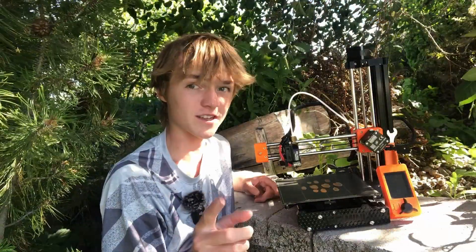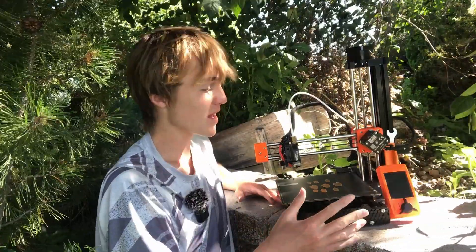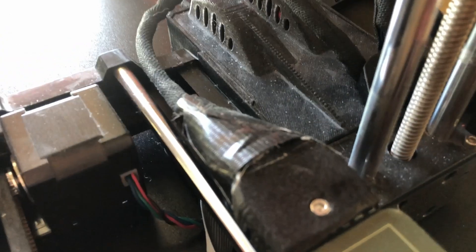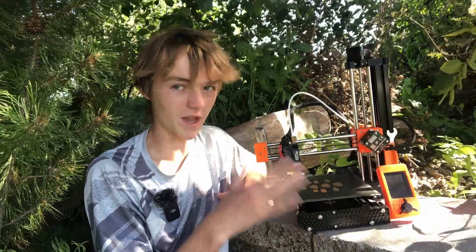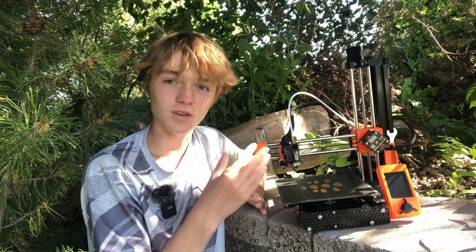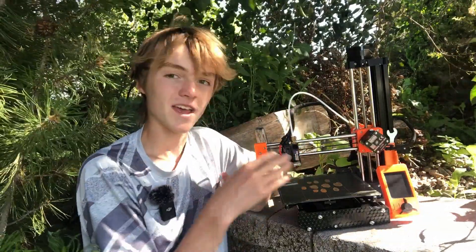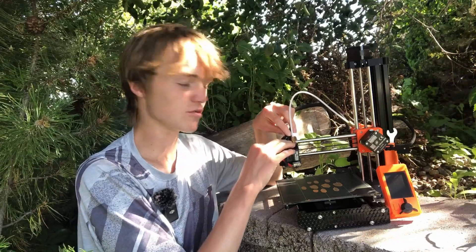The last common issue I've had is wires. This one won't be noticeable right away, even though the cause happens during assembly. The main culprit is that the sleeve isn't all the way on — as you can see, this one actually isn't all the way on right now. The same thing can happen with the heat bed. This is a really annoying issue as the printer would just start beeping without a clear explanation, telling you something's wrong with the hot end or heat bed but not really which. I suggest looking at the wires to see if either the heat bed or hot end has a clear indication of rubbing. If the wire has been rubbing a lot, you could have partly shorted it. What I did is put electrical tape — this isn't the ideal solution; you should probably just get a new wire — but it seems to work for the time being.